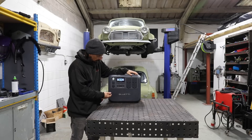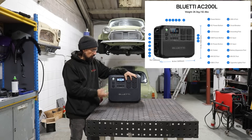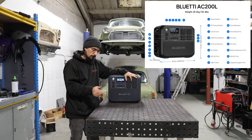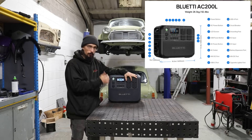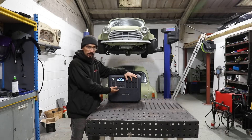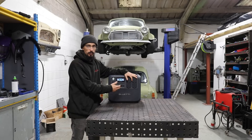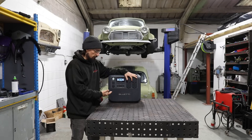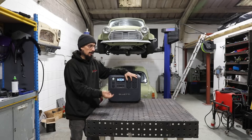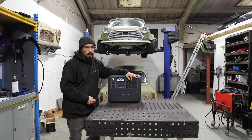The basic overview: we've got 2400 watts to play with, so a welder at max is going to way exceed that, but obviously we can find the limit and turn the welder up to a point where we reach that limit. This has also got a surge capacity - I think 3500 watts - so it'll be able to take that initial surge that the welder or any tool with an electric motor creates when you turn it on.